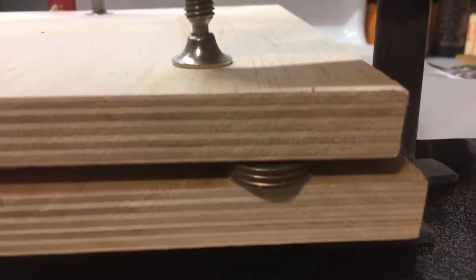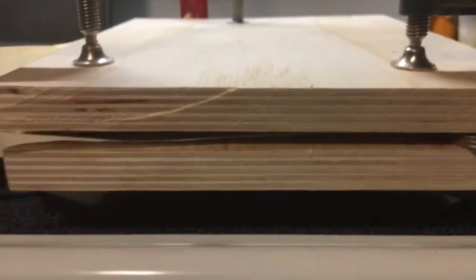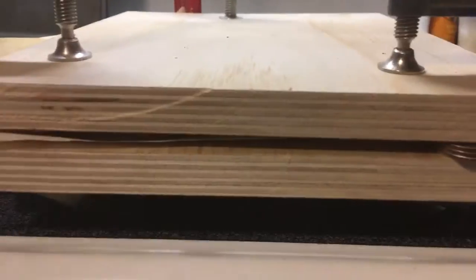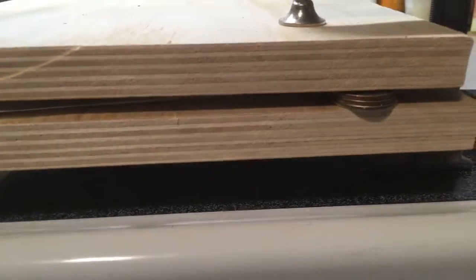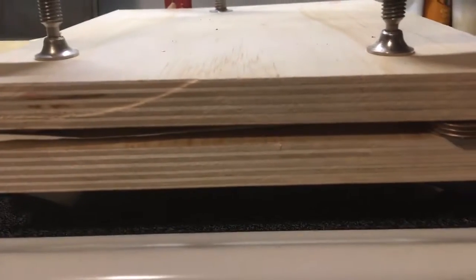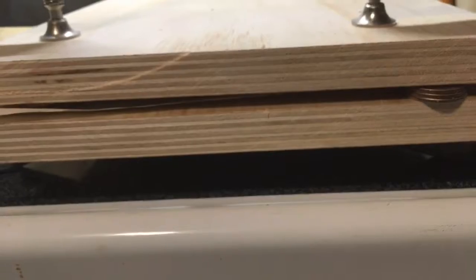Let me see if I can show you. Well, they're quarters. You'll have to take my word for it. You can't see them because they're tucked in down here, and there's also another set along the back portion. Basically, what you're doing is you're setting it so that this piece of material is 3/4 thick. The way that works is you just tighten until all three sides are 3/4, and of course you have 75 cents next to each clamp, so that when you get to the right clamping thickness, it'll stay.